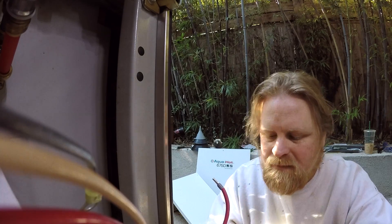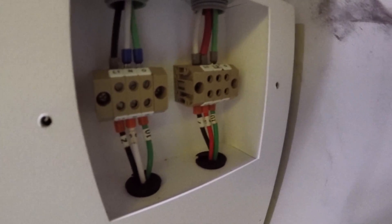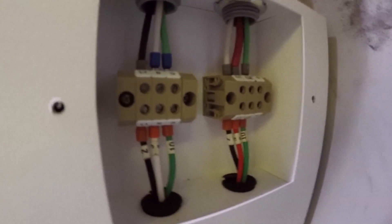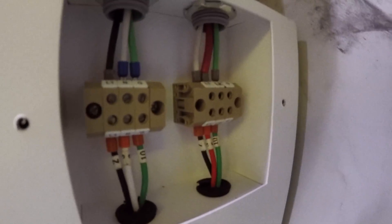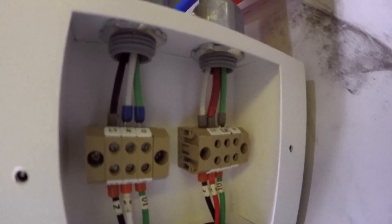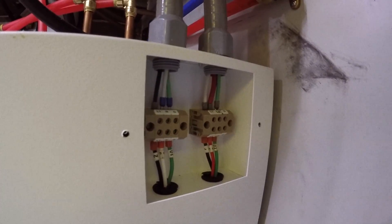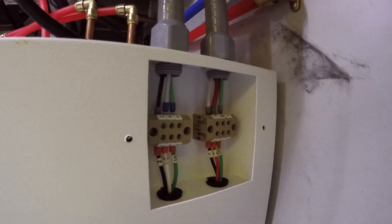Crimp and crimp, now we'll put them in. For some reason when I was setting this up, I was thinking that my 240-volt AC was actually just a 120 and a 120 combined to make 240, but apparently it has a 120-volt and a 240-volt. So I'm going to run my white as the black — when we hook it up top we'll put some tape on it so we know it's black, and put a little black mark on it down here as well. So there you have it: there's a 240 and a 120 in there, not a 120 and a 120 equaling a 240.